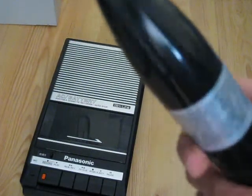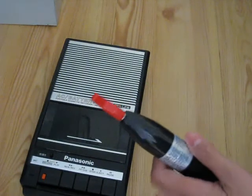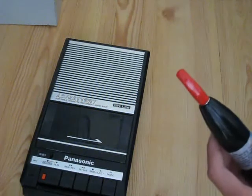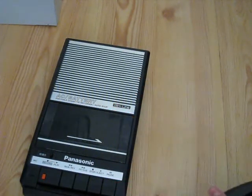Take care not to overheat the demagnetizer — do not leave it connected. Do not move it too fast; be nice and slow. And keep any pre-recorded magnetic media at least one meter away from it while it's plugged in.